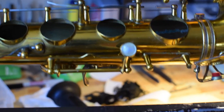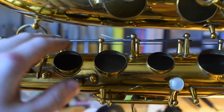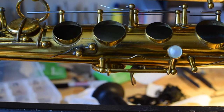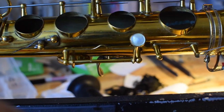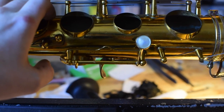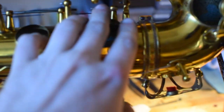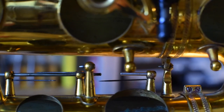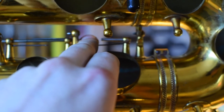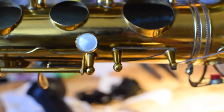Typically, once you've confirmed that the rod is straight, that we have good freedom of the rod alignment inside the post, that they're moving as freely as possible — ideally the rod is just dropping through those posts — and that there's no internal binding on the keys, that it feels like glass and you can drop the rod through each key once it's fit tight and not have a bind, then the issue is almost all of the time a misalignment of either the internal threads of the post or the threads on the end of the hinge rod.